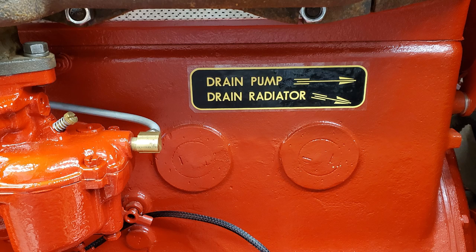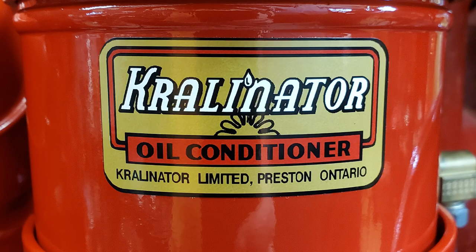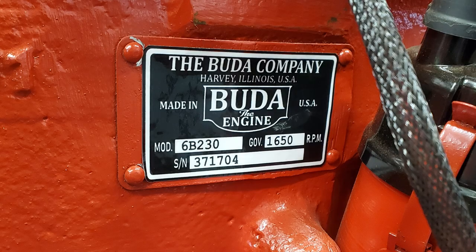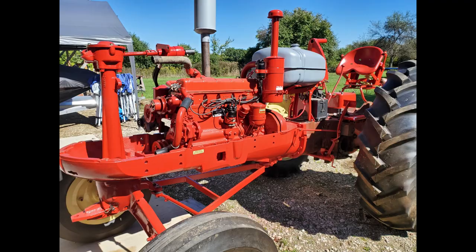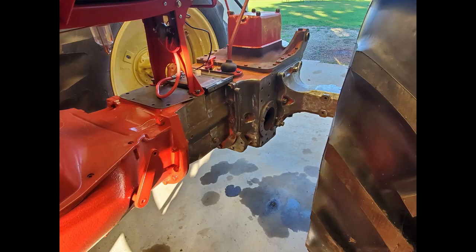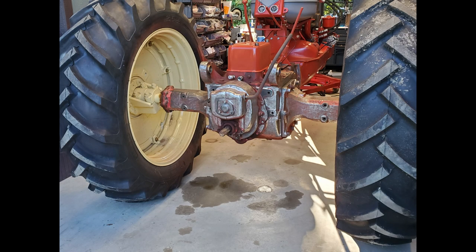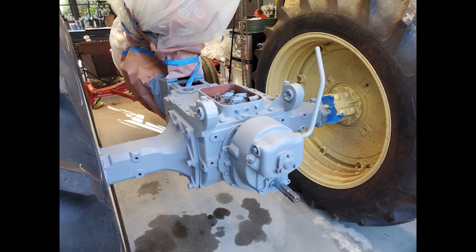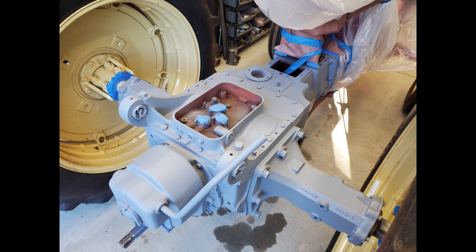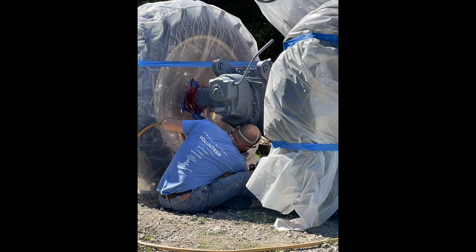The plumbing for the air cleaner and the cooling system was finished, along with installing the gauges and various decals around the engine. With good clear fall weather, the tractor was moved back outside to finish up the paintwork on the rear axle. All the surrounding components were removed, and the rear axle casting was wire-wheeled and degreased, then masked off to cover any areas that might be oversprayed. Like the rest of the frame, this got two coats of primer and then two topcoats of red enamel.